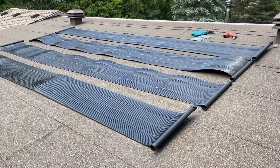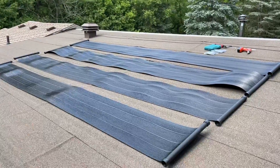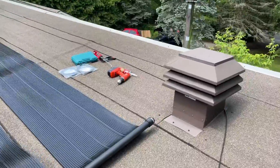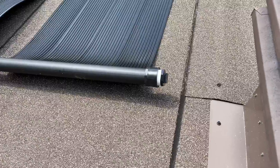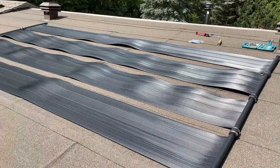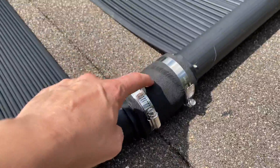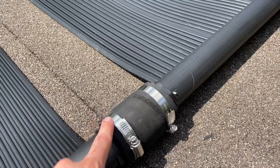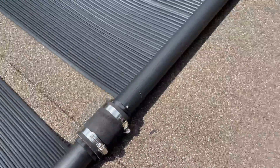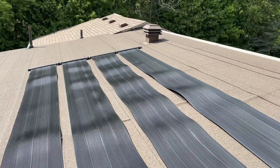We need to angle these panels a little bit so they're on more of a slope coming down to allow everything to drain through the inlet. The first thing we're doing is putting little caps on the ends where the outlet and the inlet are. Then you take these cuffs and put them in between each panel, tightening them up with these collars — not over-tightening. You do that between each one.